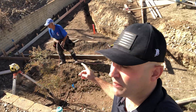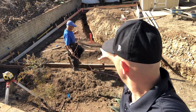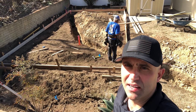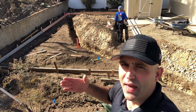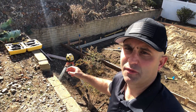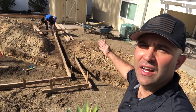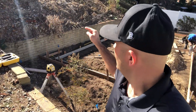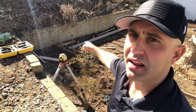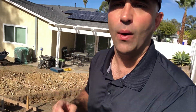Standing on this retaining wall to give you a better idea of the size of this project — the pad is around 600 square feet and the ADU will be around 500 square feet. You can see the yellow line that will be the face of the structure. We have our survey equipment to find that exact location, with offsets from not only the existing structure to the new structure, but also the distance between the existing property line, the retaining wall, and the new pad. When it's all done, it'll be laid out exactly the way the city approved it and the way it was designed.